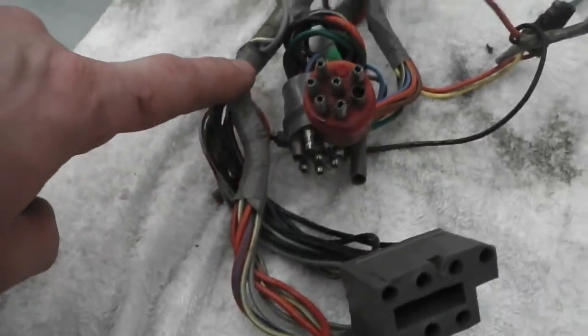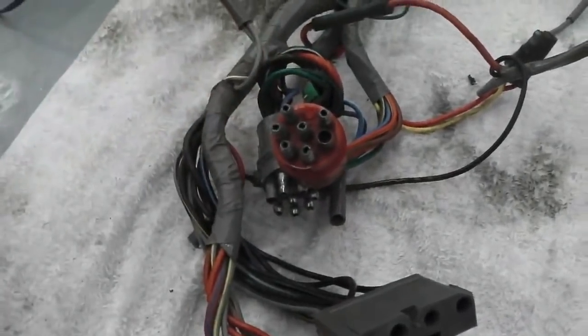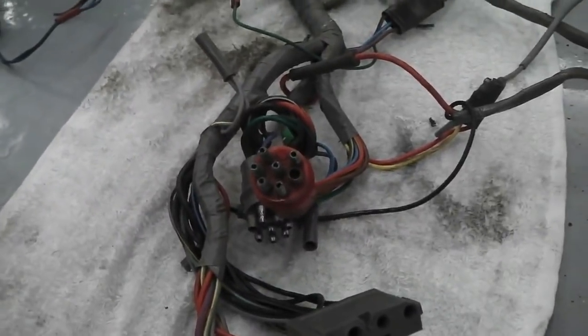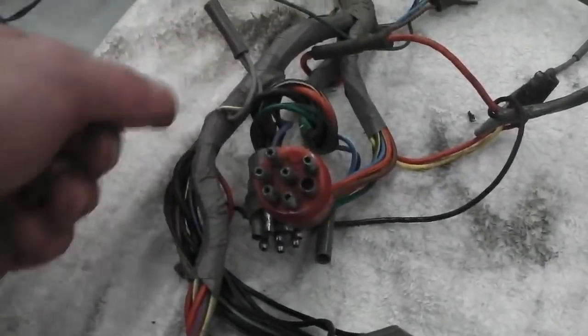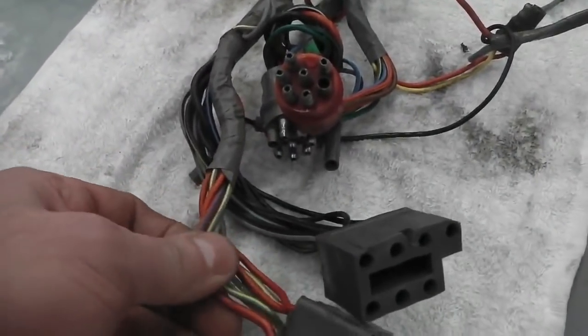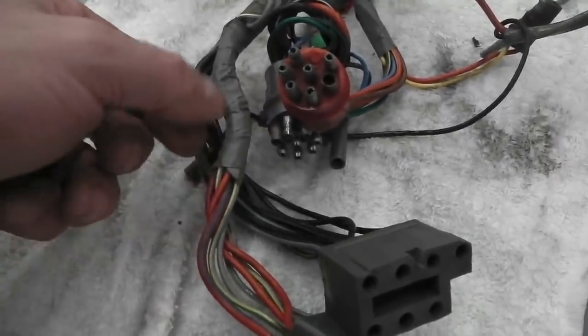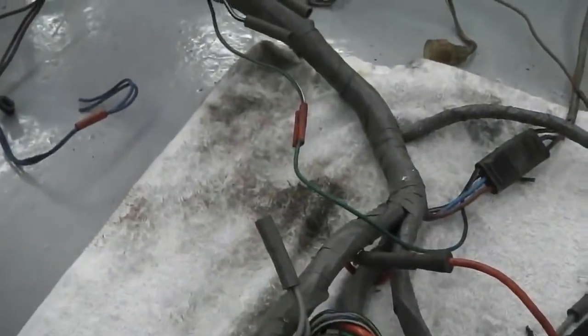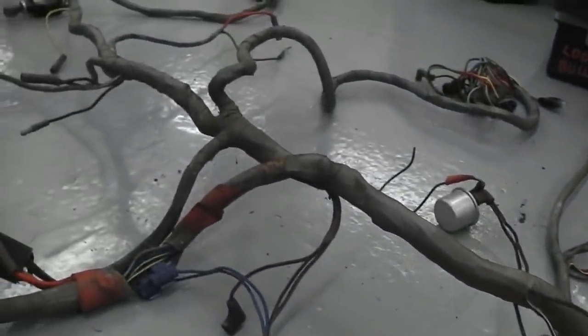I'm not breaking this down, I'm just adding the wires to it. We're leaving this original loom. The idea with electronics on this build is to add extra looms and just connect them over the top, not to interfere with this. We'll have to break into some cables, of course, where we'll cut into the wire, solder in, then wrap it in, but we're not going to actually open the loom up. It stays as one section, and there it is, disguised grey on grey.